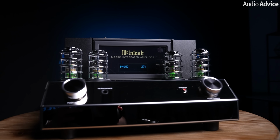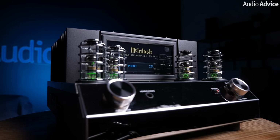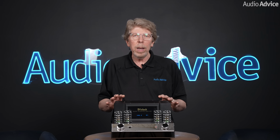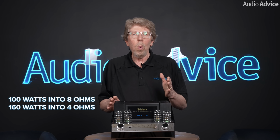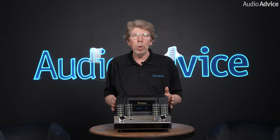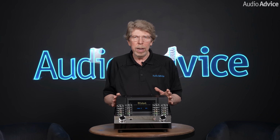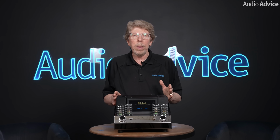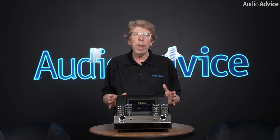The preamplifier stage of the MA252 uses vacuum tubes which give it that nice warm tube sound, while your speakers are coupled to a solid-state power amp that can deliver 100 watts per channel into 8-ohm speakers or 160 watts per channel into 4-ohm speakers. The great part about the MA252 is McIntosh did not have to start from scratch for either the preamp or power amp section. With several tube-only preamps and dozens of solid-state power amps in their lineup, the engineers were able to use the tech and circuit design developed for these more expensive products in the MA252.